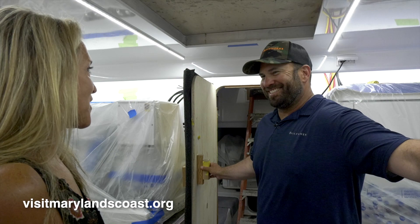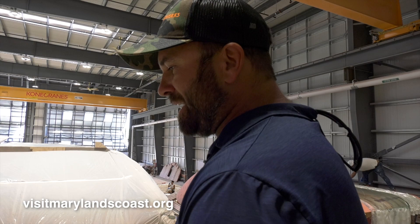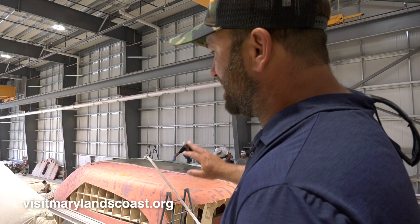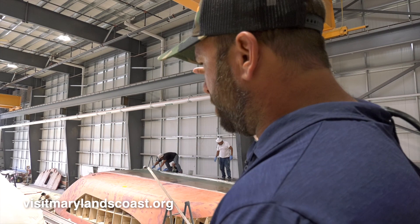This gives you an idea of how the hull would look once you flip it over and fiberglass the interior. Before you paint the exterior and interior, it's just raw fiberglass. We try to keep it really nice and tidy so you can see what kind of fiberglass work we're trying to accomplish. Over here we're just starting to fiberglass the cabin of the 66. You can see the core cabin — that's made of I-80 core cell, a four-pound density closed-cell foam. We'll apply two layers of 1700 biaxial cloth to that. Once it's glassed on the outside, we'll glue the flybridge onto it, then cut the fixture out of the inside and fiberglass the whole interior shell as well.